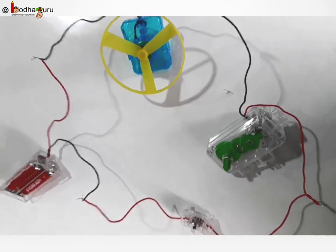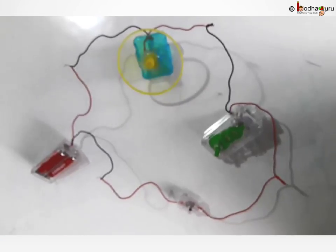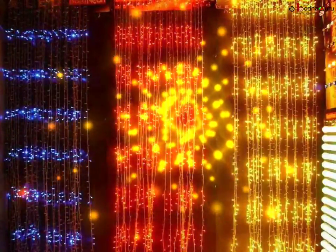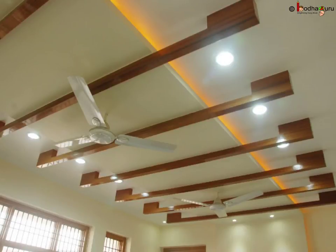One important thing to note: when you have such a circuit, if current stops flowing through any one component, it stops in all of them because the circuit becomes open. Like in old electric lighting used at weddings — if one bulb goes bad, the entire strip of small bulbs stops working because all the bulbs are connected in series. But series circuits are also useful, like when you want to turn on all the lights of a false ceiling with one button.